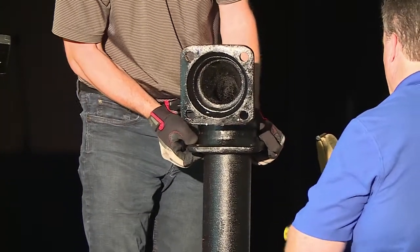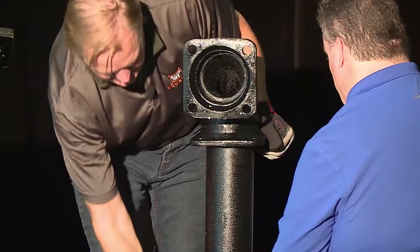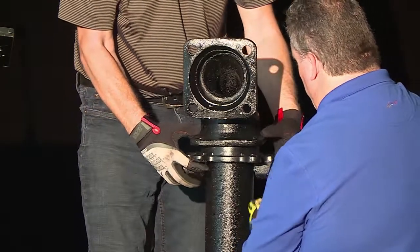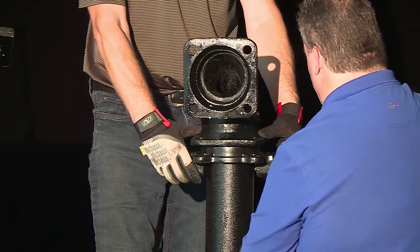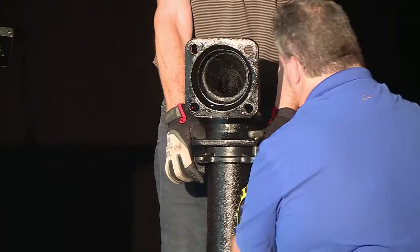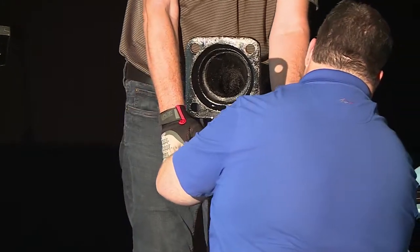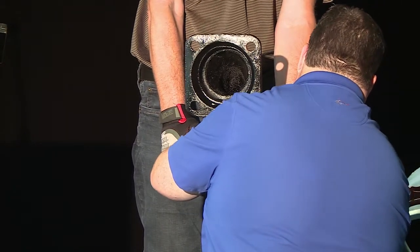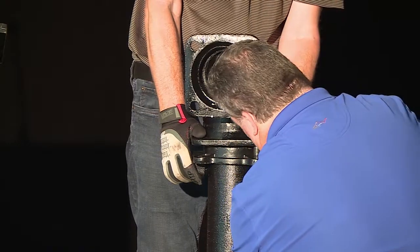Okay. So what we're going to do is bring that restraint up. The T-bolts will drop through the top so that we have the T's against the body of the MJ fitting. Is it 90? There we go. We have to make sure it's fairly 90, otherwise our contraption here won't quite work with the pre-cut pipe. There, get that on there. All I need is one.